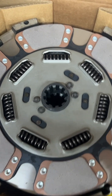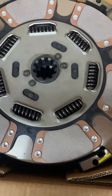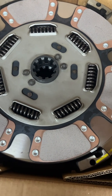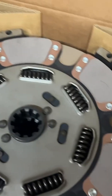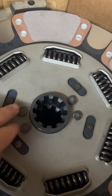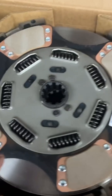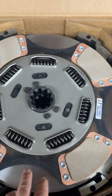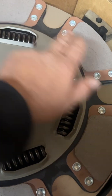There's another clutch made that is a seven-spring, six-pad clutch as well, that does not have as high a torque rating as what is often thought. If you look at this six-pad clutch, you'll notice that there are only four rivets on here, which is the exact same as the four-pad clutch. So the only difference between this four-pad clutch and this six-pad clutch is that it has two extra friction pads on it.